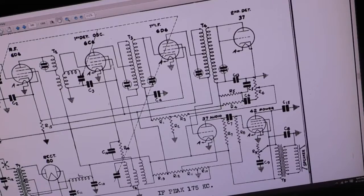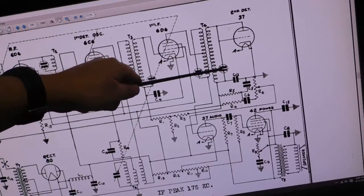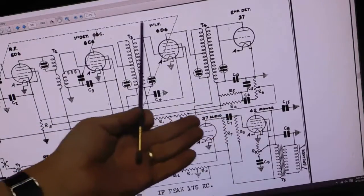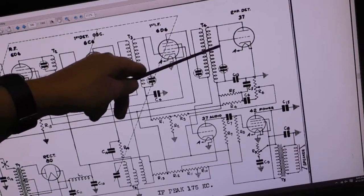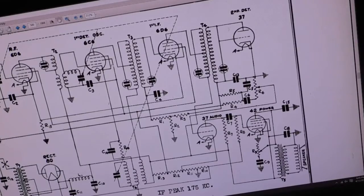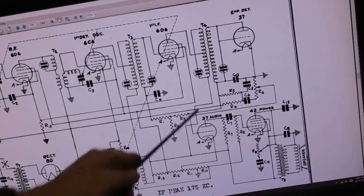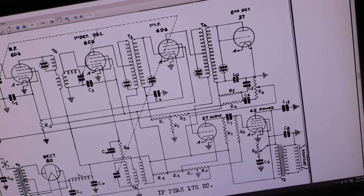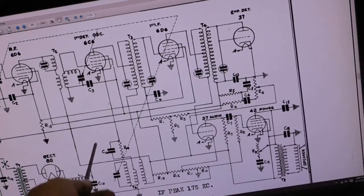On the schematic diagram, it happens to be this one here, T4. Do you see there's a capacitor going across, just like any other IF. Low frequency IF, you've got a regular standard tank circuit here, the capacitor and a coil. Well, you notice they're in these little dotted lines, and you also notice there are no arrows or anything on them because they're non-adjustable. But they're there. Capacitor, capacitor, capacitor, capacitor, in both IFs.